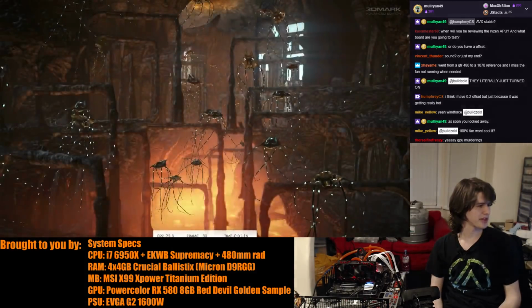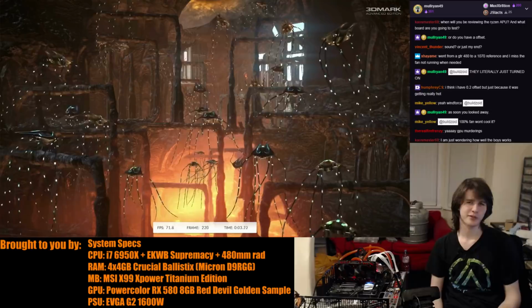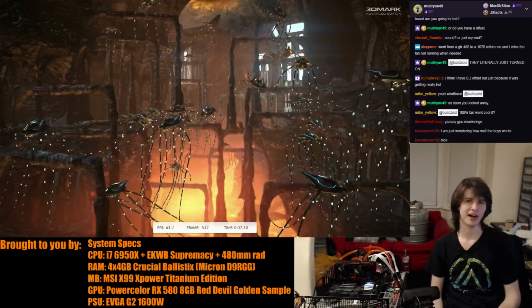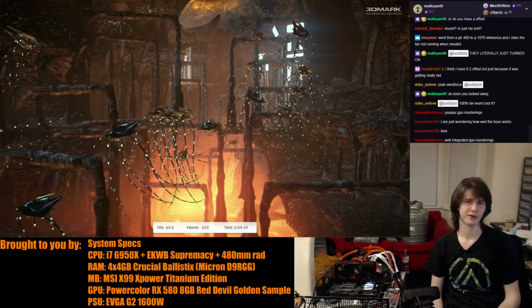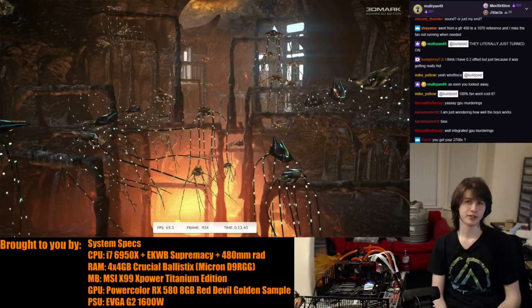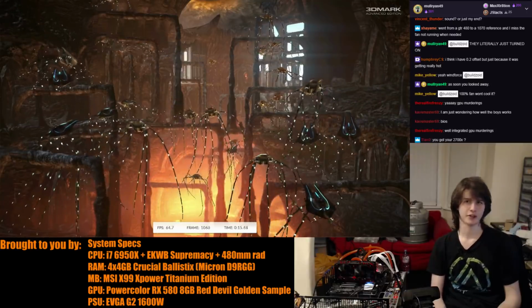Well, 100% fan won't cool it. I think with 100%, the 290X Windforce still hits like 75 or something. It's not cool enough. And still, you should only go to like 1.3 volts, which, if you want to know what offset that is, that's plus 100 millivolts.